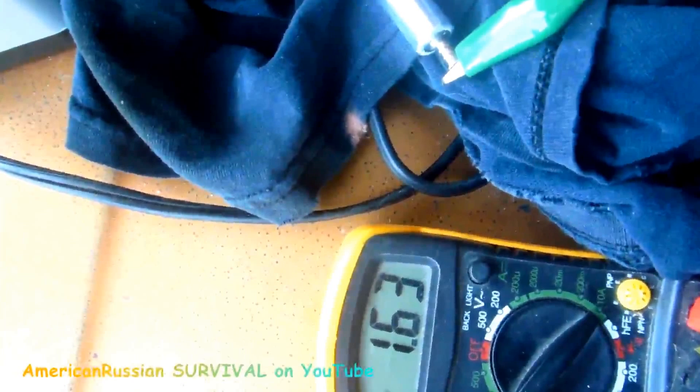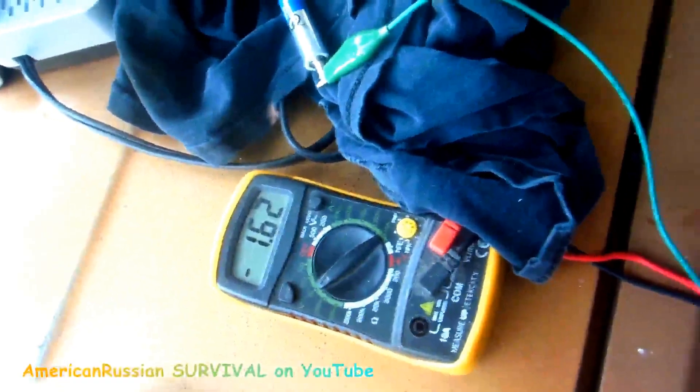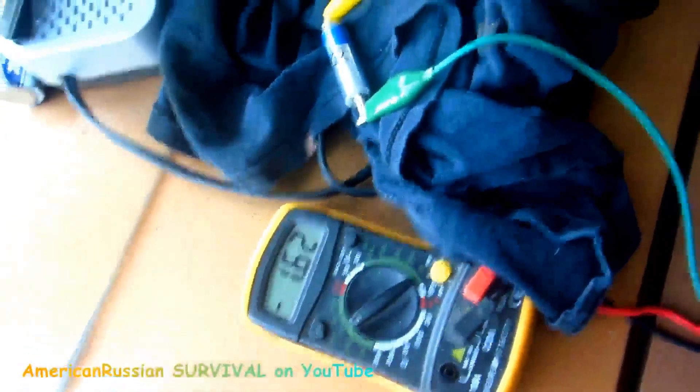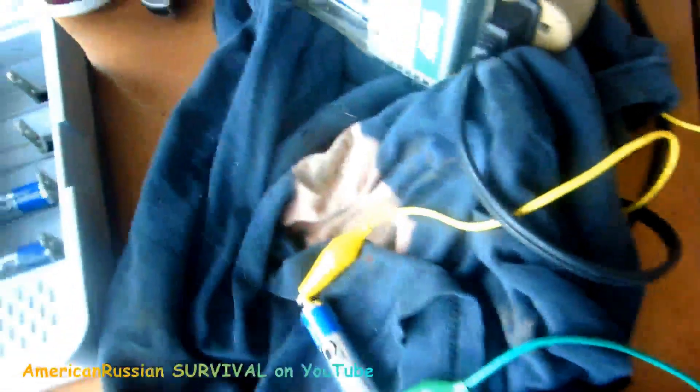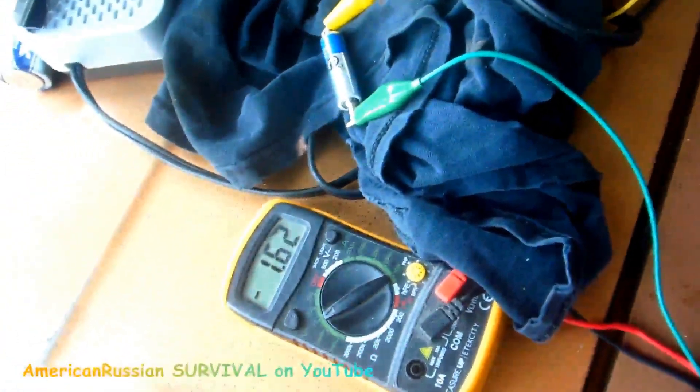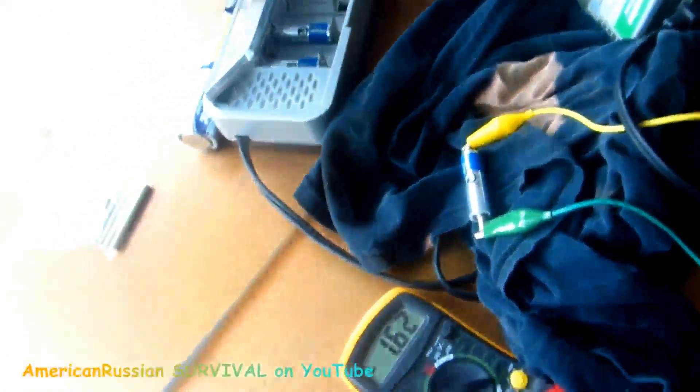This one held its resting voltage — I think I charged it last week. Resting voltage isn't a perfect indicator of battery strength, but I probably reconditioned it with some luck. When you stick two batteries in the cheap charger at once, you're not necessarily getting 100% equal charge rates — it's pretty cheap. With the Bedini charger I prefer charging one at a time. Even on setting one, for triple-A's you put them on for like five minutes. With D's you can leave them on for quite a while.